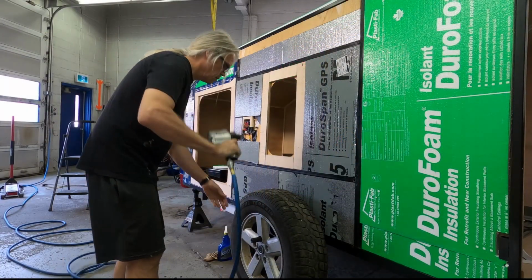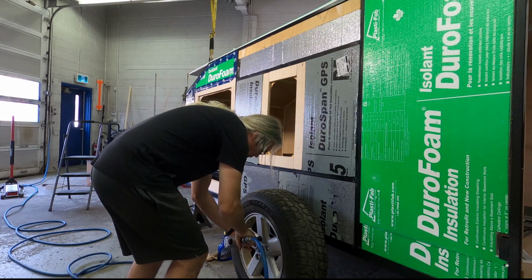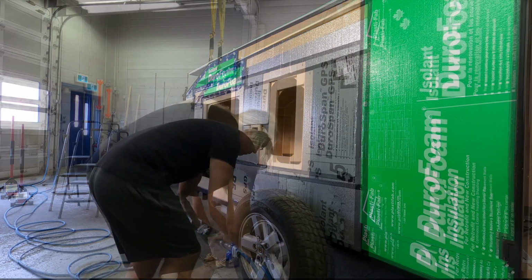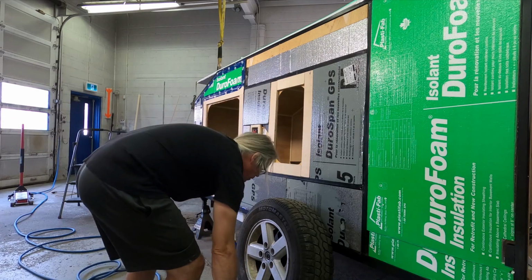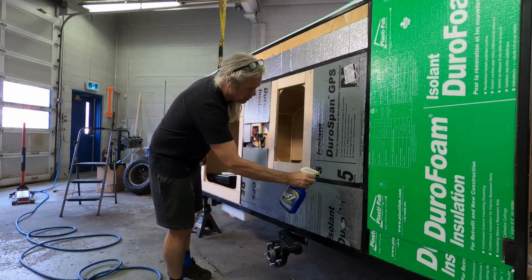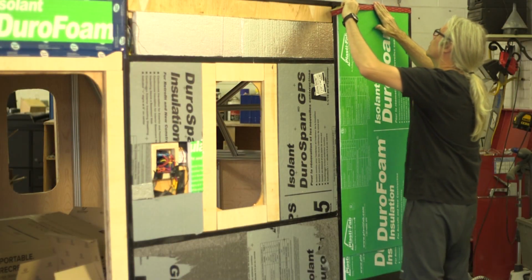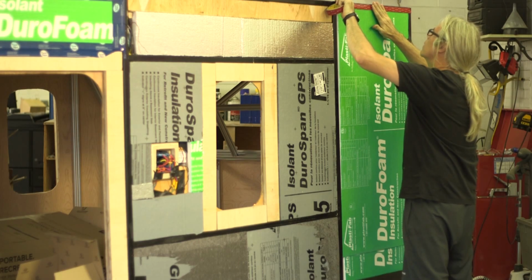Now it was time to jack up the trailer, get the wheel out of the way, get the trailer down on jack stands, and get it ready to install the wall. I use isopropyl alcohol to wipe down all the points of adhesion for the VHB tape. You don't want that stuff coming off. It's insanely expensive, so you get 1 crack at installing it and 1 crack at making that wall fit.